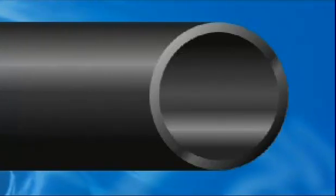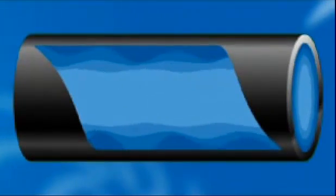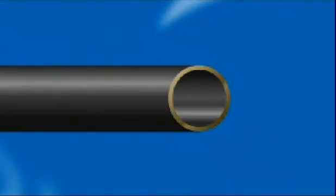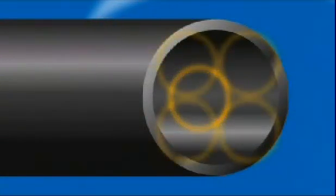The internal surface area of your pipe can make a huge difference too. In our example, we will be using polythene pipe. When the diameter of the pipe is increased, friction loss is reduced. More water can flow through the middle with less touching the walls of the pipes where friction loss occurs. When the pipe diameter size is doubled, the actual area of water flow is increased fourfold.